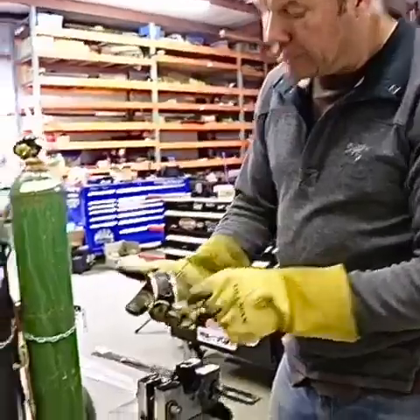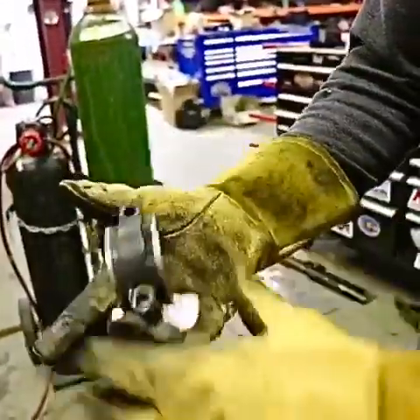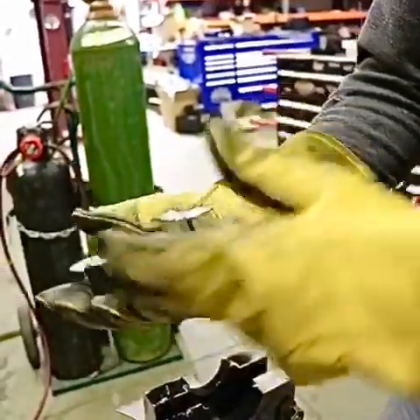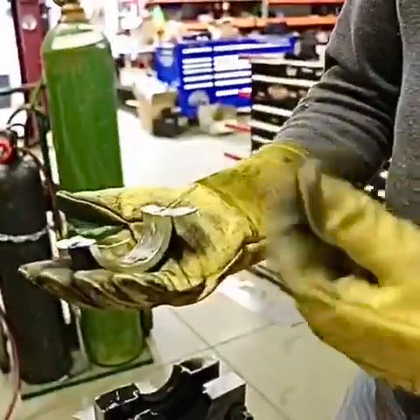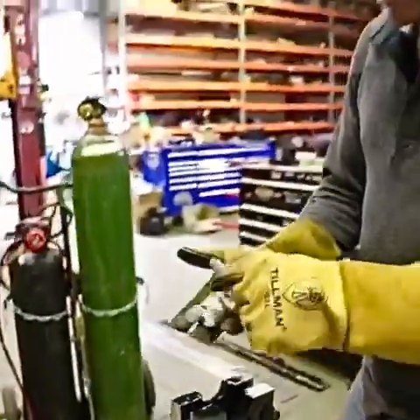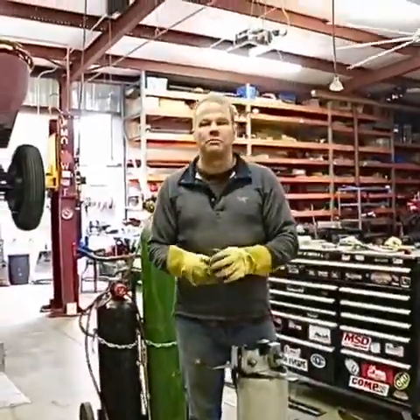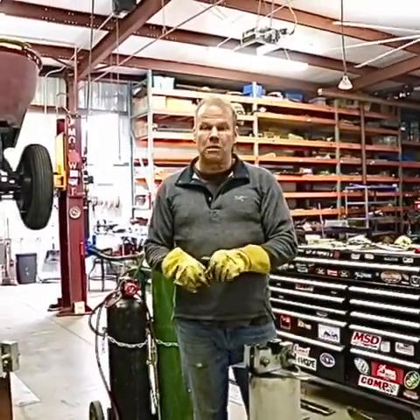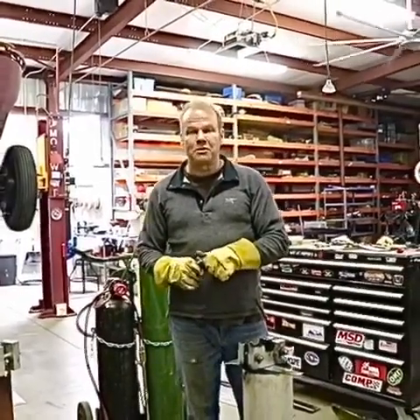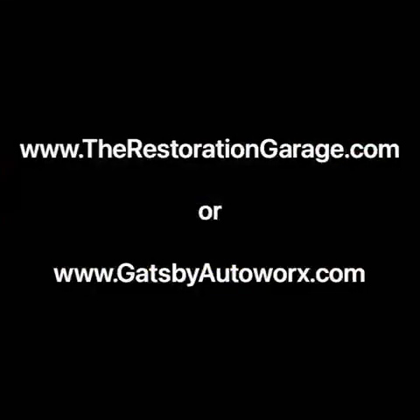But you see how we've done it. Basically we've made these sides wider, so when we get ready we can machine the sides off to the width we want. We've oversized the bearing so we can machine out about 20 thousandths inside and it'll fit the crank — then we should be ready to go. Thank you for joining us today on The Restoration Garage. Go to our website at www.therestorationgarage.com. We'd love to hear your comments regarding this video. Have a great day.